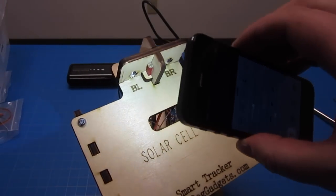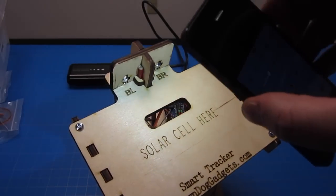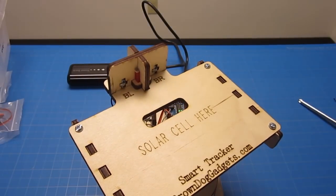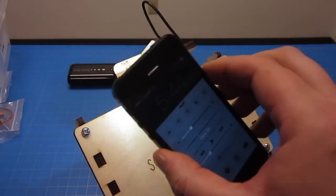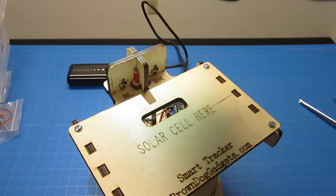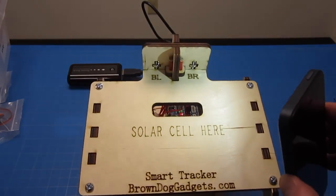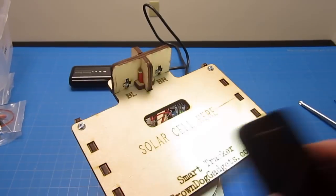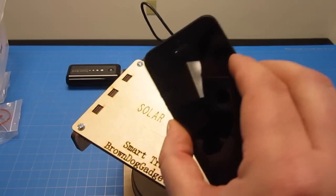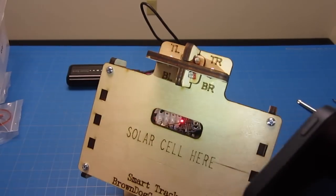Use a flashlight or other light source to test out the range of motion and sensitivity, and also to make sure everything is hooked up correctly. If you need to re-home or change where home is for your servos, you can easily do that by undoing one screw. It's often very handy in case of an issue, or if you want to change your code to change the range of motion. So that's the project — thanks for watching, and if you have any questions you can leave a comment or shoot us an email. All the files, descriptions, and write-ups are on our website browndoggadgets.com. Feel free to modify and change these things for your own personal purposes or educational needs. Thanks a bunch!